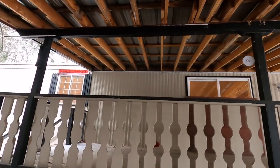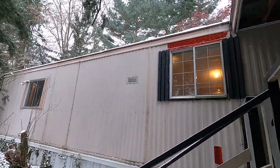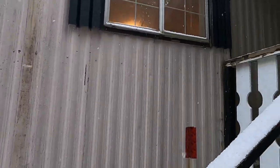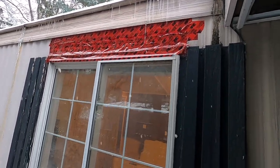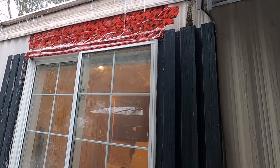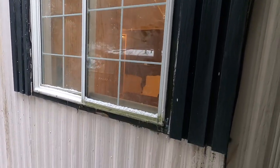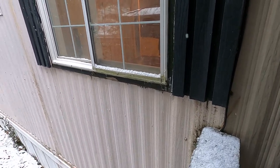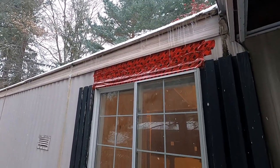We're replacing this again with a pitched asphalt roof — it won't have this shed roof. We'll be putting an overhang on, and one of the reasons we want an overhang — this window here is a good example. You can see how the icicles and stuff are coming off that roof and basically coming down onto the window. I've put tape on there to keep the water out. What's been happening is the water comes down the roof, down the wall, and into the top of the window, then running out on the sill inside with some damage in the wall below. That'll all get fixed when we put the overhang on and put eavestroughs on — it will completely eliminate that problem.